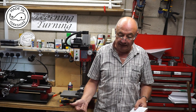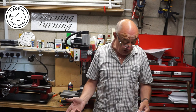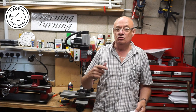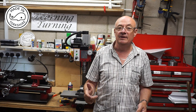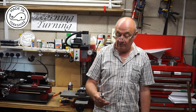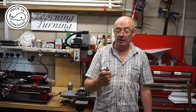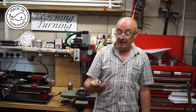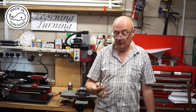Before I get on to that I'd like to thank everybody for the help and support provided, it really is very much appreciated. In particular, thanks to the Pist Office for the advice on how to make a little device to centre up your rotary table quite easily. My rotary table has an MT2 taper in the centre, and the suggestion was to get an MT2 taper blank and turn the blank end to fit into the collet chuck - turned down to 14mm and it works an absolute treat. I'm over the moon with that and I'll show you it working later in the video.